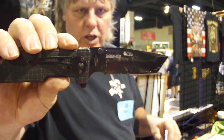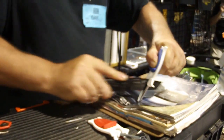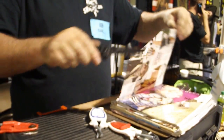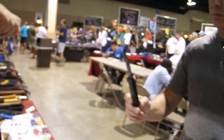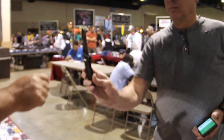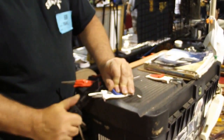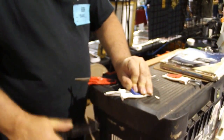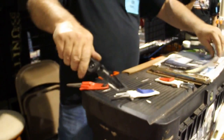Here's a knife made by Tactical Team — serrated, with a tanto blade. Take the serrated edge, roll it in the middle. No metal comes off at all — drops down in between every tooth, top to bottom, shaving sharp. Feel the bite on the teeth. Now on the smooth edge up front, squeeze it real tight, draw through. The pin's made to flex so it follows the original bevel — takes the guesswork out and puts the original edge back on the blade. If you buy a good expensive knife, you want to keep that original edge.